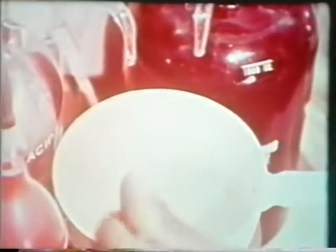Now add the nitric acid carefully as you stir the contents. Continue this process until the blue-violet or deep red color changes to yellow. Then add exactly 1 milliliter of nitric acid to obtain the proper acidity. You are now ready to start the mercuric nitrate titration. Stir the solution and add mercuric nitrate until the casserole contents just change to a blue-violet color. A faint blue color will first appear. Do not mistake this for the blue-violet color.